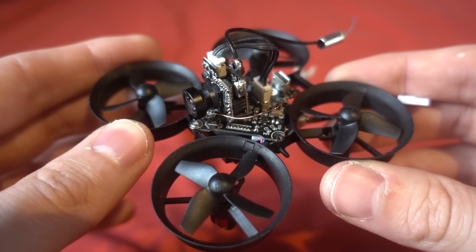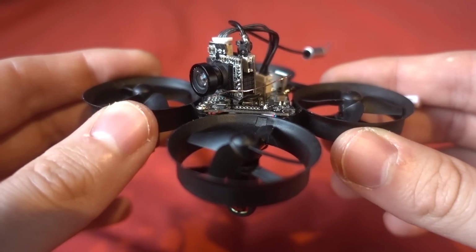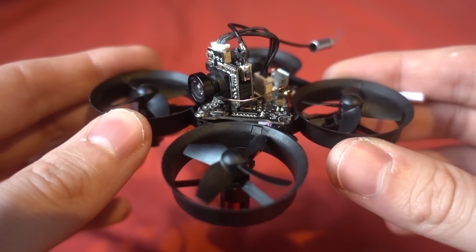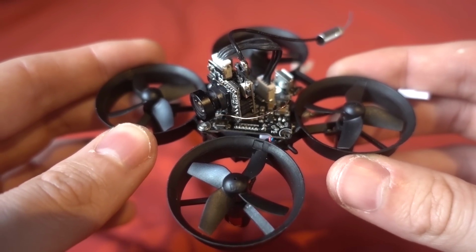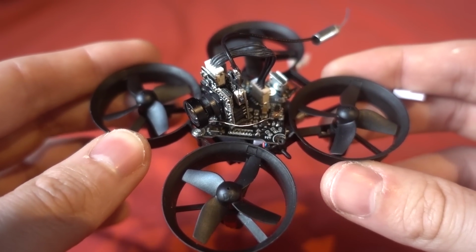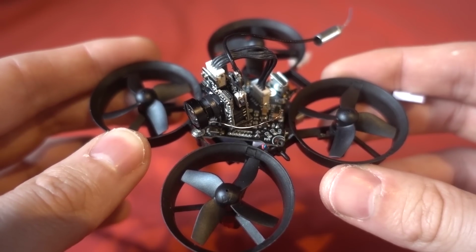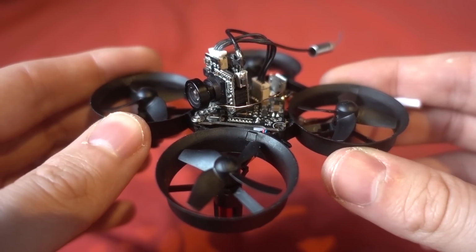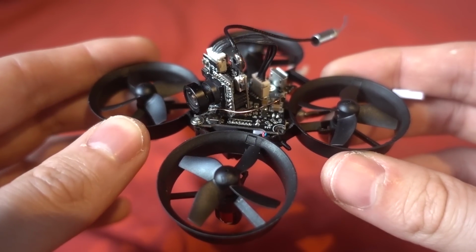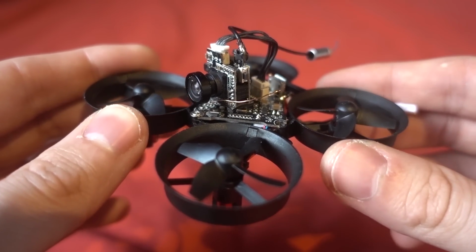Now, this is the D8 version, so you can't do Lua scripts like you can with the D16 receivers, and apparently the FlySky version will also send your telemetry voltage back to the transmitter as well. But for DSM2 and DSMX, it's not mentioning any telemetry, so bear that in mind. There is a slight downside to this protocol though. The bind sequence is different.